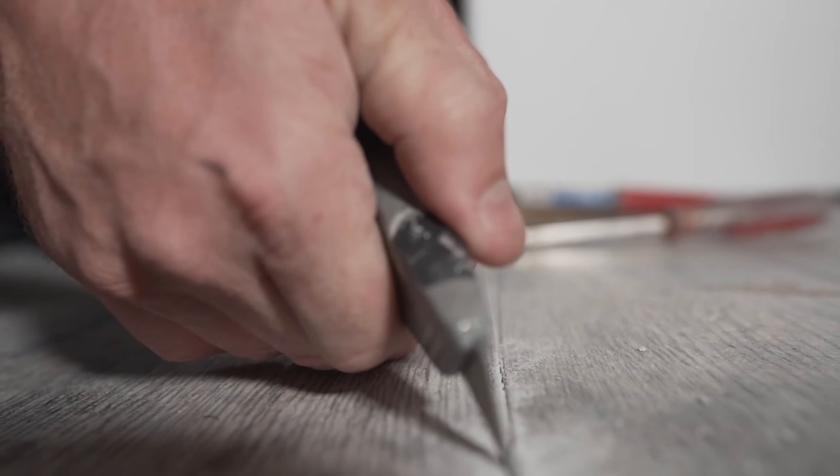After this is all cleaned out, make sure your piece of tile fits. All my stuff inside the house is either tight joint or 1/16th because I like it when the joint is small — it looks really like wood. If we put an eighth-inch or 3/16th joint it's not gonna look like wood, but this way the tile makes it look like wood. This stuff was from Home Depot, nothing special, but it just looks cool and the coloration hides any mess.